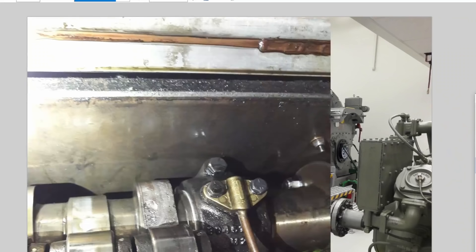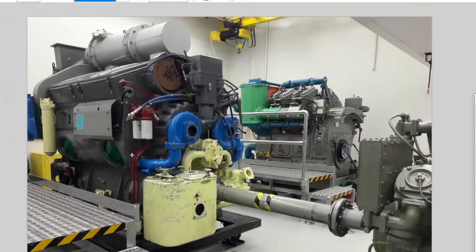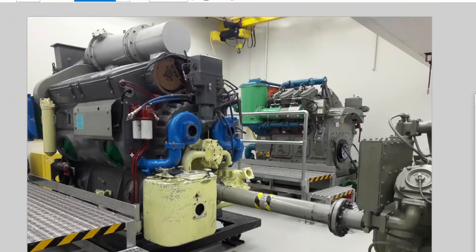Here's a better picture of the other end with cam rollers — this is a really pitted cam that needed to be replaced. You have cam lobes on the camshaft that actuate the rockers and rollers. The shape of those lobes actually determines when the exhaust valves open and when the injector does its thing. That is all within the top deck cover.